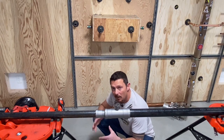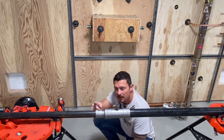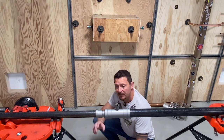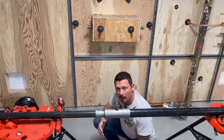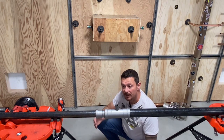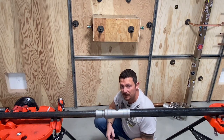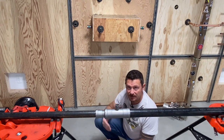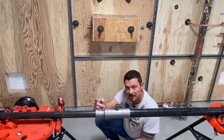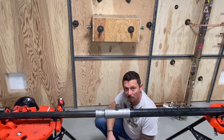Now I want to press two joints here on the two-inch, and then here on the inch and a half for this fitting reducer. If I couldn't get to the top and I wanted this to run straight, I could press on opposite sides — press this fitting here and this fitting on the other side. I'm going to press the two-inch here, and then switch sides and press the inch and a half on that side of the pipe.